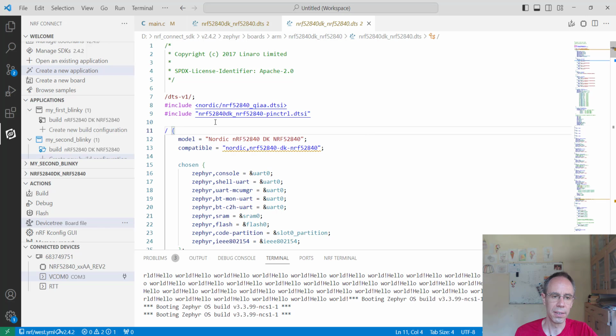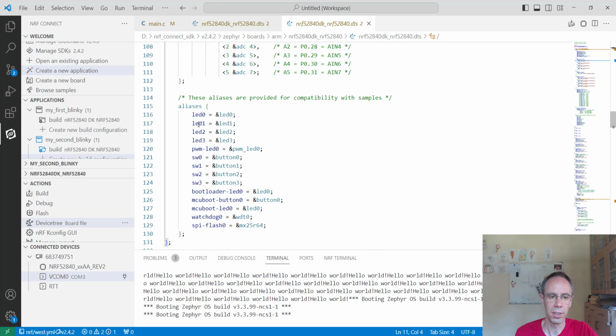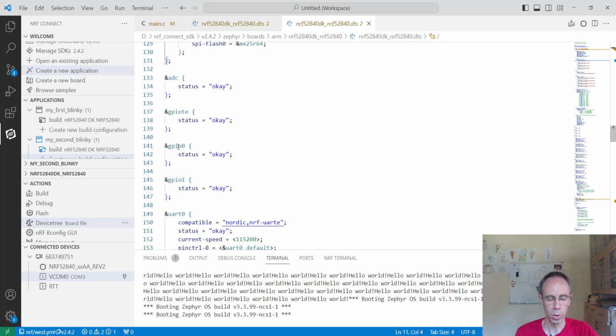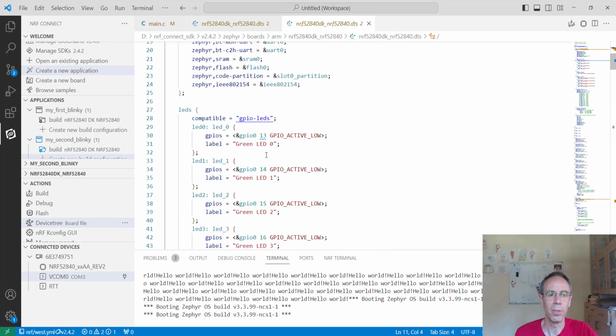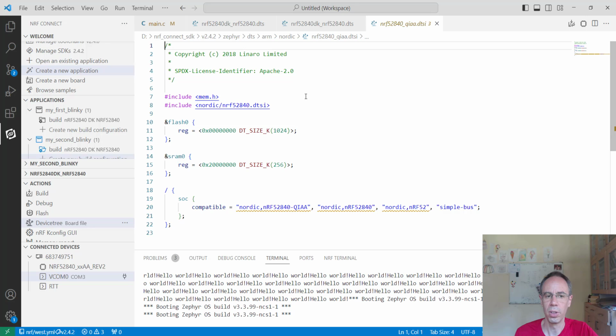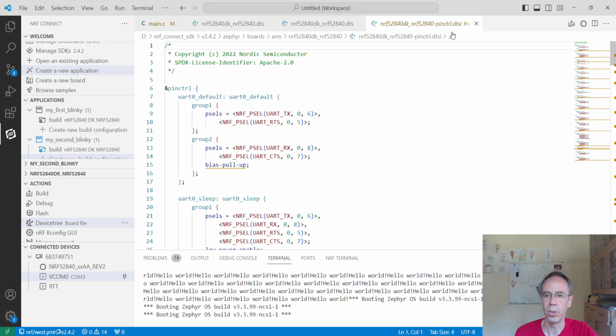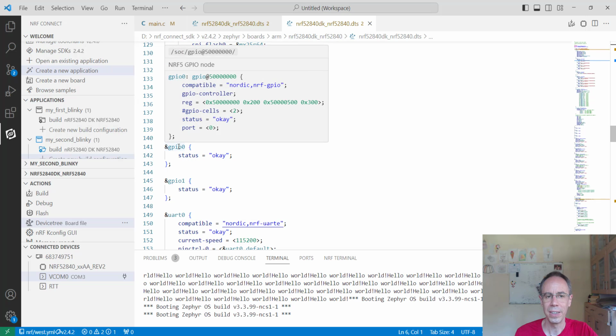And it's really a tree, it's done hierarchically here. And what we are searching for first is GPIO 0 here. Yeah? And you're seeing here, this is just an overlay file from our developer kit. When I look at the base file from the microcontroller, you can click on it too. There it's all already defined, and then the second file and so on, and they're then combined. But when I go to GPIO 0 and hover over it, then I also see parameters which are set. And for the first beginnings, the GPIO number here, which is the name, is important.